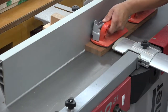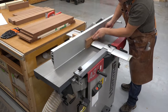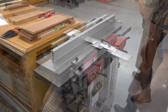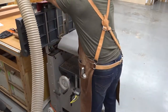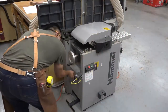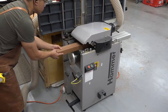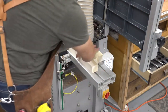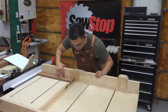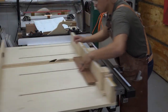I then go to the joiner to flatten one face and one perpendicular edge, and then plane down to final thickness and width. I get a lot of folks interested in planer-joiner combo machines asking me how much of a nuisance it is to switch between jointing and planing. In my case as a one-person shop it's a non-issue — I batch out all my parts on the jointer before switching into planing mode; it takes all but a minute to switch over. I gang together multiples of the same part through the planer for consistency. I also milled up some test pieces out of spare poplar for fitting joinery. Finally, once everything is square and parallel, I cross cut the parts on the table saw with my cross cut sled.